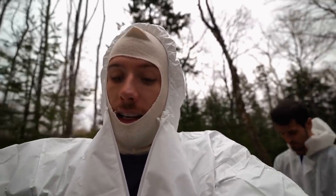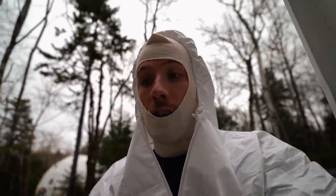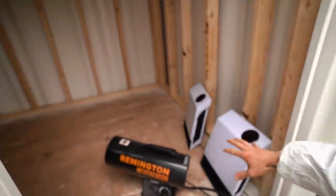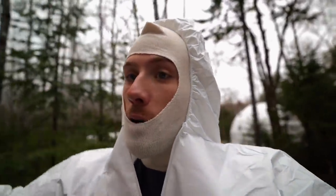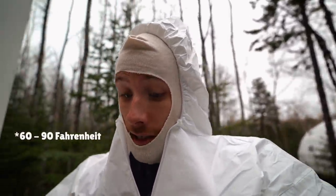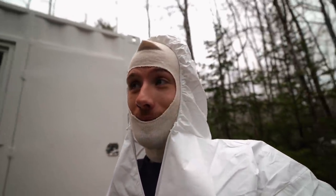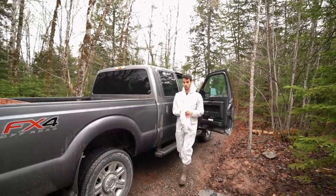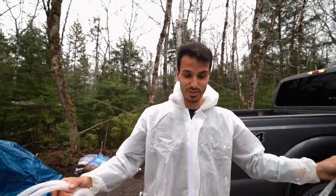It's not the warmest day here today, and it needs to be a very particular temperature in order to do the spray foam insulation. So we've had these heaters set up here for the last hour, and now the container is warm to the touch. It needs to be between 16 and 32 degrees. I don't know why it needs to be that specific, but it does. It's specific, but oddly a large range. Yeah. 16 degrees is a big range. I get 16 to 18, but 16 to 32 is a stretch.